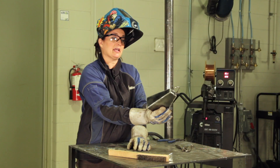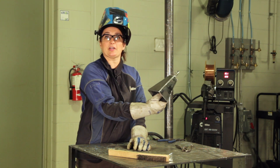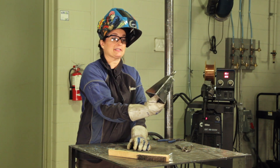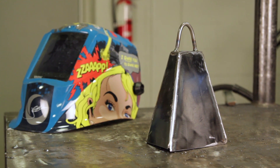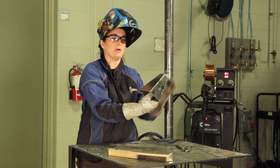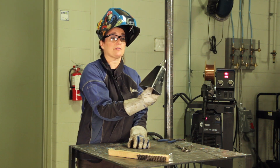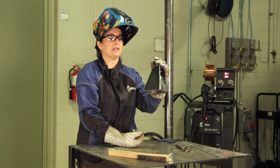As you can see, the edges look quite shiny now because after I welded it, I took the time to use a flap wheel. You can use a grinder too, or if you have a flap wheel, that's even better. Take off any rough edges and just buff up your weld, and then it's in perfect condition to either clear coat it, spray paint it, or decorate it in any way you like.